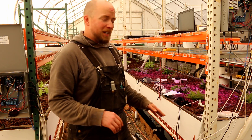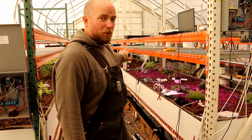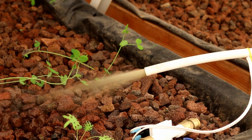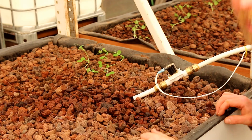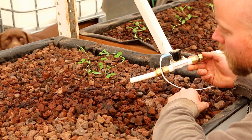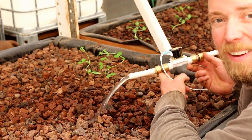I'm going to go get the air compressor and we're actually going to blow this line out and see if that can help with it. It looks like up front here we're getting plenty of flow, but as we move further down the line we're losing flow rate and that's causing our problem. I'm here at lane two bed four and it's getting ready to come on — if my idea was right then we should get some pretty good flow here momentarily. There we go.